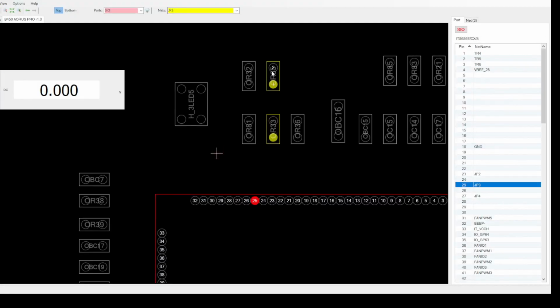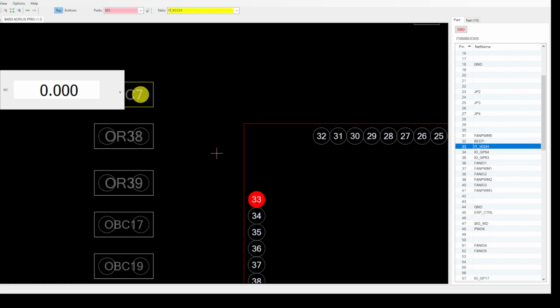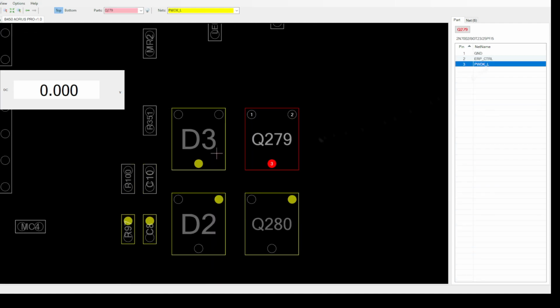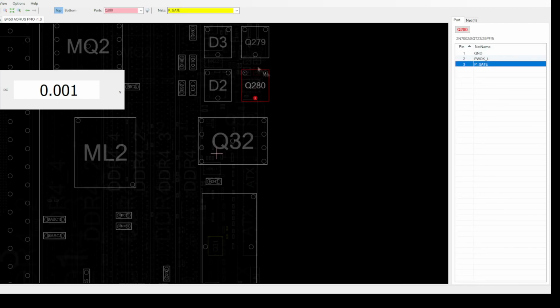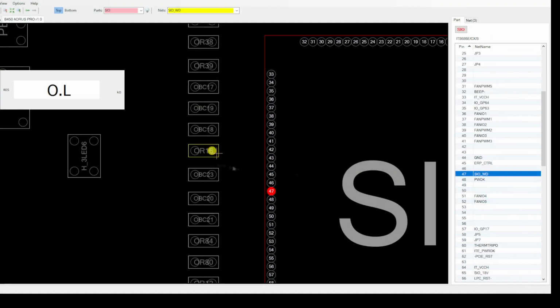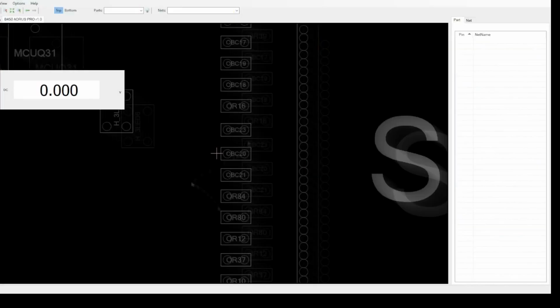MOSFET. And today I went ahead and looked at the SIO, because the SIOs are mostly responsible for holding reset and for looking at the incoming voltages from all over the board, all of the power good signals. And what I was doing, because I had really no point where I could really look at something I was suspecting a problem, I went around the SIO on every single pin and tried to figure out, okay, which of these are necessary for us, which of these might be important and which are not.